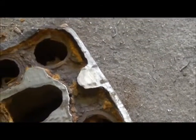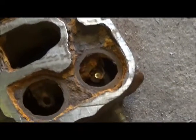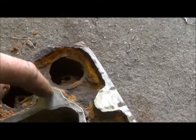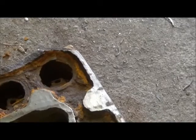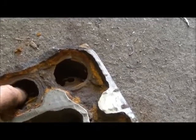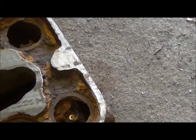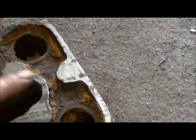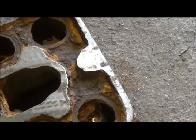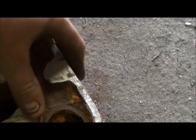Then we can get a plate made for it — probably use a thick plate, maybe half inch or something like that. I may have to groove the plate over for the exhaust port. There's going to be pressure on one side and pressure on the other side of each piston — they can't tie together because of the timing issue. It's just going to take quite a bit of work, but I'm sure we've got enough here.